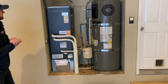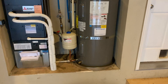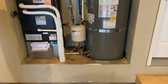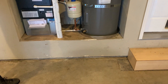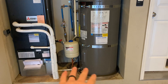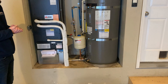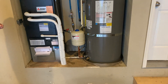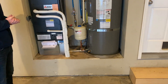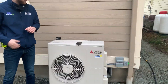The one thing we added to the heat pump water heater that Kyle thought was a good idea — and I agree — is the drain pan sitting underneath the water heater. You don't always see those in a garage because people think if water spills onto cement it's no big deal. But those are shared walls with the house; we don't want any flood damage, mold, or to compromise that plywood sub-base. That's why we put it in, and the drain line goes all the way to the outside.